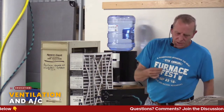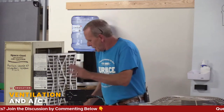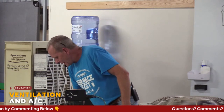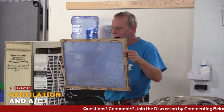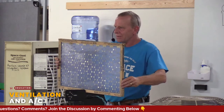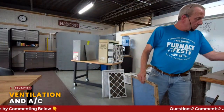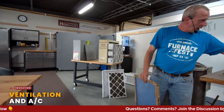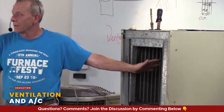So change that filter. Make sure that air can pass through that filter. How much level of protection you want, as far as what it pulls out of the air, that's up to you. I will say this: the ones I have a tendency to stay away from are these guys. And why is that? There is not much in here that's going to stop much, right? And where is it going to end up? All on the bottom side of this, because that air is moving this way, right? I've seen these where we pulled them out, and it is nothing but cat hair on the bottom of that.